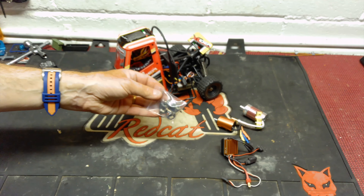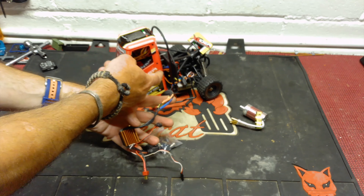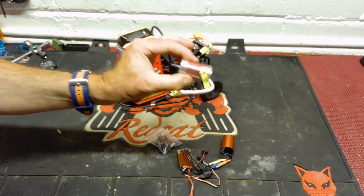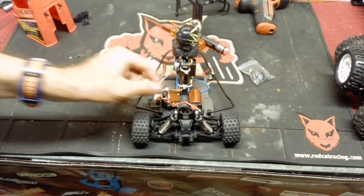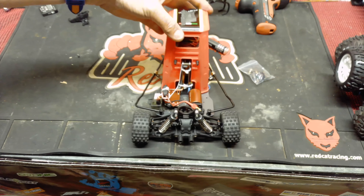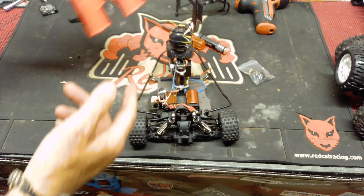Moving straight on to the X Flamingo Rider: I've got my metal differential kit from Banggood to fit to the car. I've also got this brushless ESC — while it's currently running on a brushless ESC it's only 2s capable, whereas this one is 3s capable. I'm going to see if I can squeeze this 3s motor in there. I've got the new 35-amp ESC and 4800 KV brushless motor — the bigger motor was simply too big to squeeze in. I've also tidied the wiring: if anyone is doing the same conversion, you need those wires nice and tidy at the back because the body slides backwards, so all the wires need to fit through neatly.